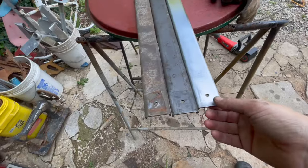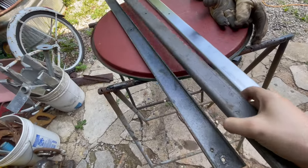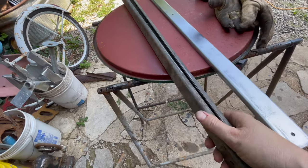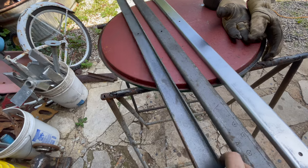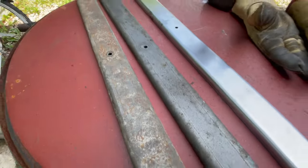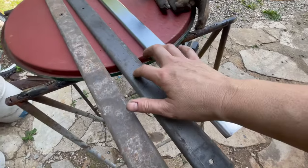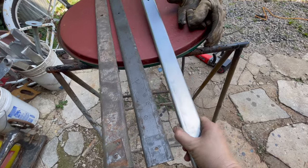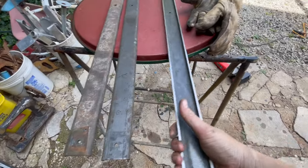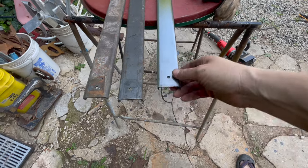Here's the before and after on the front little sliders where the wheels go. These go together like a two and there's a gap there. The wheel that does the lift arm sits inside there. They're just kind of starting to show their age. They were coated with the same type of coating that's on steel today. Here is with just one pass of the surface conditioner. I'm going to call that good because I'm going to paint them anyway. I'll wipe it down with some degreaser and then some acetone, but that looks much better than it did before.